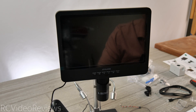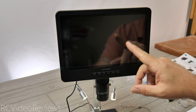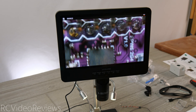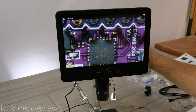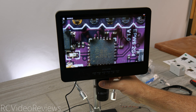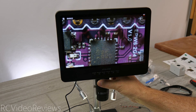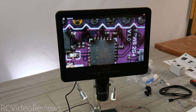It's time to fire it up. With the wires connected, press the power button — that turns on the spotlights and the monitor. After the welcome screen, drop your sample underneath the lens. You set the monitor height mechanically to position the camera, then use the focus tube just below the monitor and twist it to get a sharp image on the screen. It took me a little time to find that focus tube, but once I did, we got a very nice crisp image.